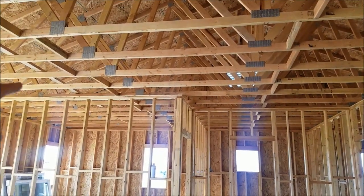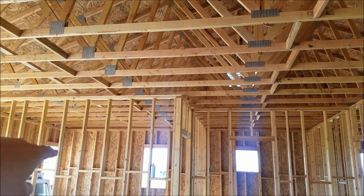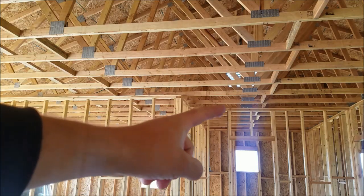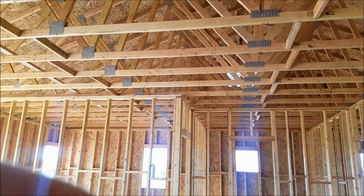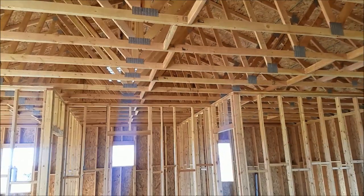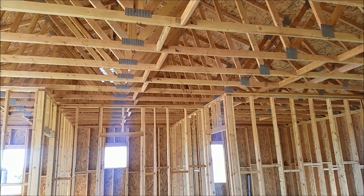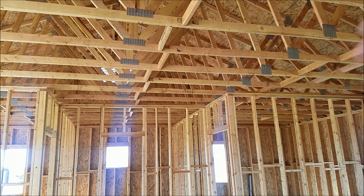The 2x4s — I already put one up here. It's a 20-foot 2x4. It's supposed to be 10 feet on center. So from this wall to about here is 10 feet, then another 10 feet — we're at 20 feet now, which is the middle of the building. Running down the middle, 10 feet over is about where that road blocking is, and the next 10 feet is the wall. So we only need three: two on each end, one in the middle.